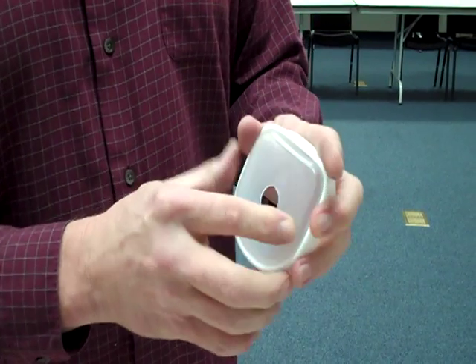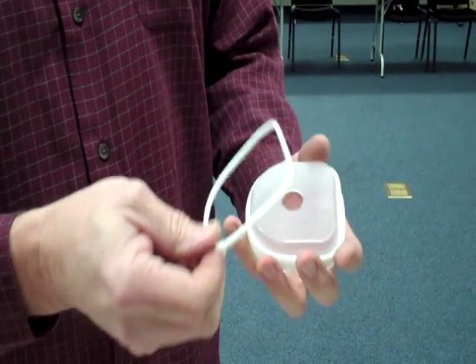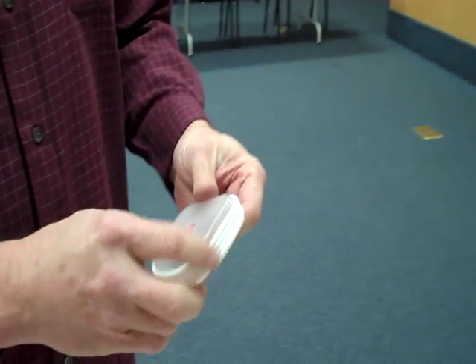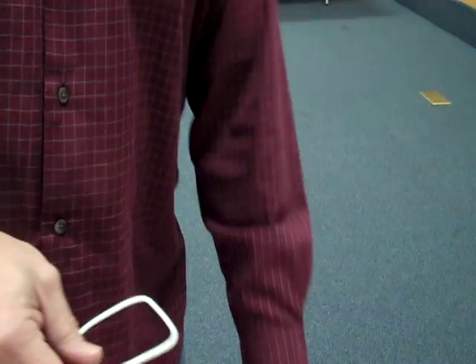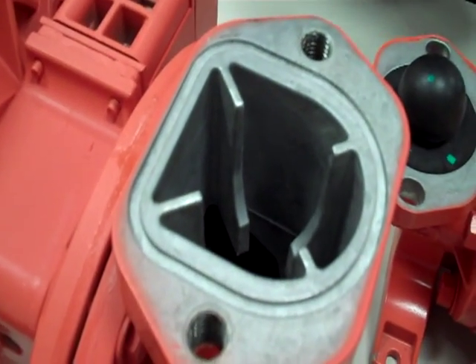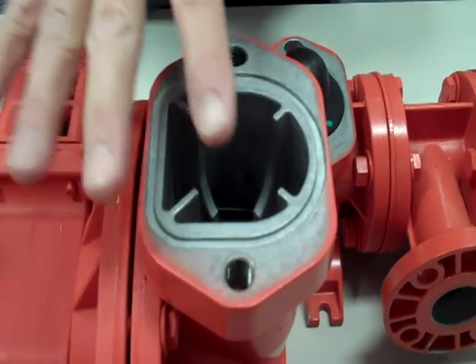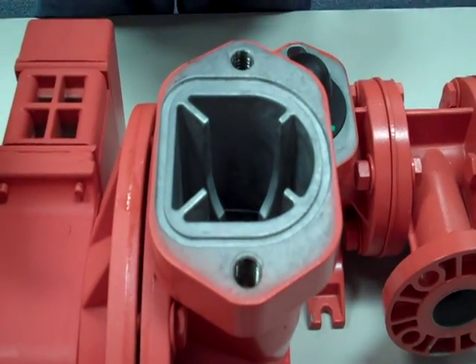While they do come on this form, which gets them into the shape of a D very closely, it still isn't enough to adequately get them into the shape needed for installation onto the pump manifold. What you want to do is, once you get your center section built up, you're going to start with the inlet side first.